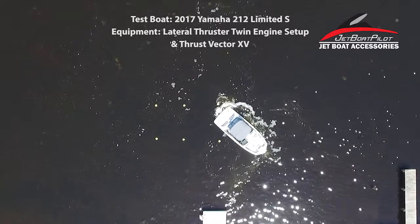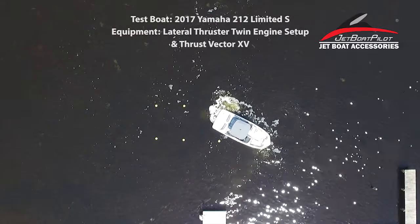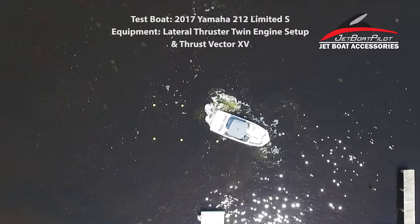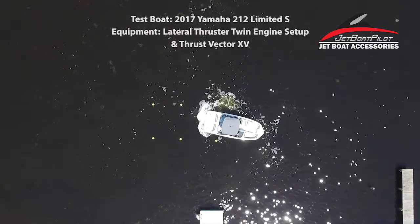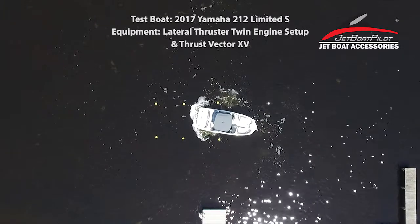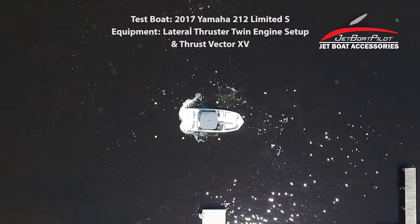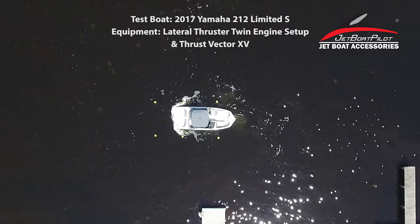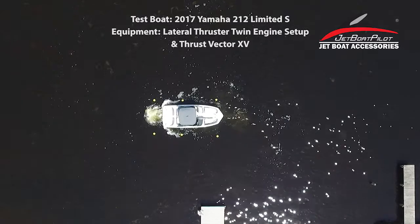Right away you'll see we have a push from left to right. It gives us the ability to control the boat slowly but effectively into a tight quarters area. As we maneuver back we will increase the power a bit, again controlling the stern from left to right. Then as we back it into our spot, once we find the spot we want to stop, do a little forward throttle that will kill the momentum, and then of course we can just turn the engines off and throw anchor.